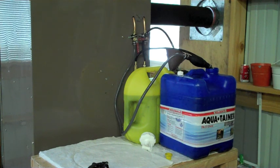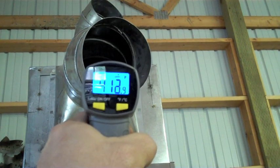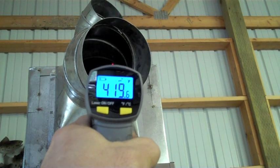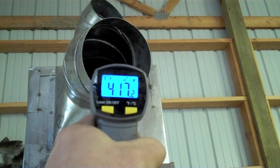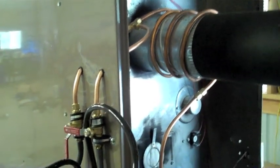Follow the line out of the blue jug — you can see the valve is on, and it's putting out more heat than straight diesel. I have one of those infrared thermometers — see what that plenum reads. It's about 420 degrees Fahrenheit, around 418 to 422. That waste oil is doing a great job. I think what really helped is this copper line I put around the exhaust preheating the waste oil — it seems to work very well.